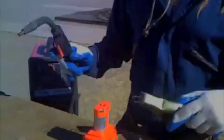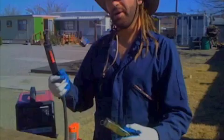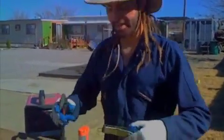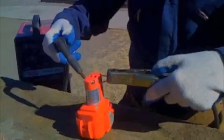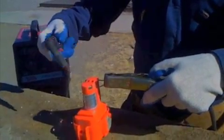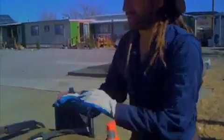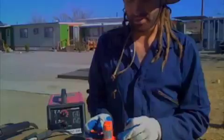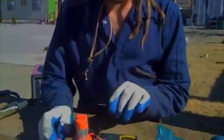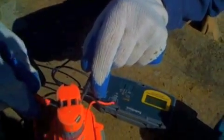Turn it on. For this I don't use any mask or goggles because I'm just lightly zapping it. What I'm going to do is run it backwards. On my welder, my ground is actually the wire feed, so I'm going to hit that against the positive and take it even lower since this is a memory battery. We do a quick voltage check and what we'll see now is that the voltage has dropped because we've been running the welder backwards. Our voltage now is about 7.37, so a slight drop.